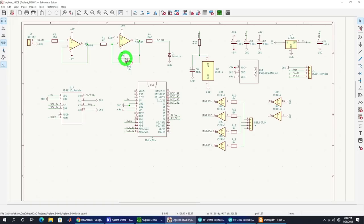A 500 ohm resistor provides protection in case something is shorted. There's a 1 kilohm output resistor with a Schottky diode in reverse bias to prevent the ADC input from going below zero. So zero to minus one volt becomes zero to plus two volts. The analog section runs from plus and minus 9 volt power supplies drawn from the unit. For the data converter, I'm using an ADS1115 with an I2C interface connected directly to the microprocessor — it's a 12 or 16-bit converter, more than enough for our needs.